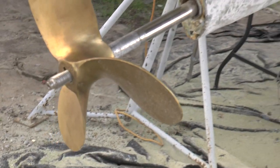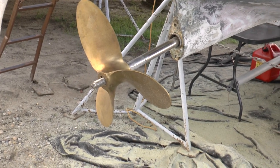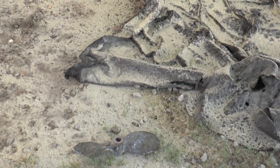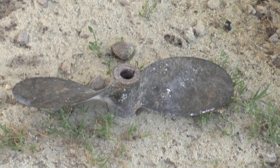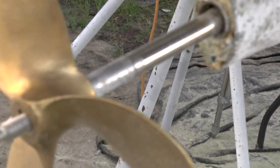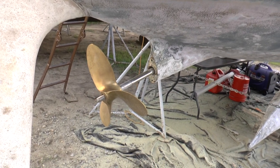This is my new prop — a 16-inch, 11, three-bladed prop, which is replacing the old 13-inch prop that had way too little blade for the 30 horsepower Yanmar that's in the boat now. It's got a brand new Yanmar 30 in it with probably 15 hours on it.